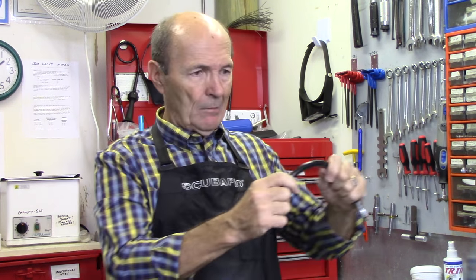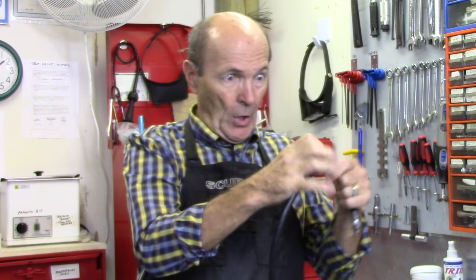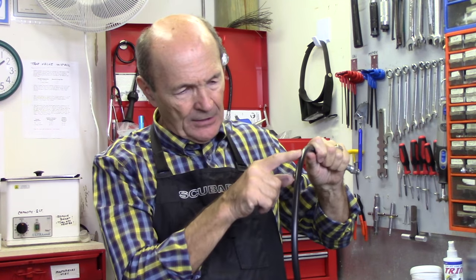Look at that, guys. Pretty soon that bump becomes a grape. And holy, look at this. Pretty soon, and I've seen them as big as a pear, as big as a plum, a big lump like this on the hose. Hey, stand back. It's going to blow. And it will blow. This rubber coating on the outside will actually split and blow. And then the high pressure will start coming up. Used to be that way. Not anymore. Modern high pressure hoses have changed.